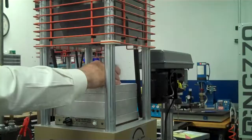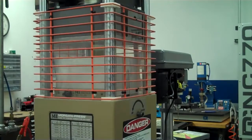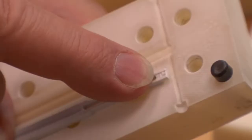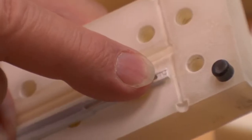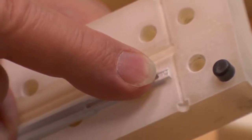A mold this large — when we put it in our Morgan press, we'll clamp it with eight to ten tons of pressure. No problem at all. It doesn't mind. You can see this tiny little feature here — that part of the mold was 3D printed in, and we were able to hold that little tiny shape.